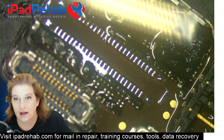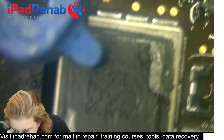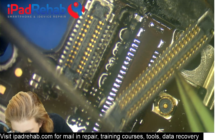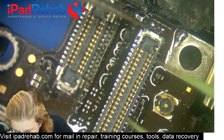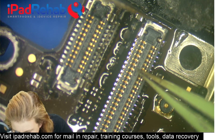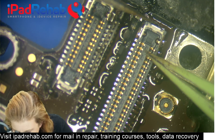All right, I have my new connector ready and I'm going to place it on the board. I place it on the board using a two-tweezer method — I'm going to grab the outside of the connector with one set of tweezers and use those tweezers to position it, and then I'm going to use an inside set of tweezers to really seat the connector so that I can have it flat on the board.